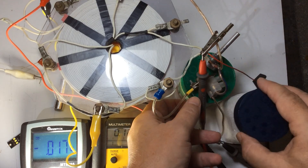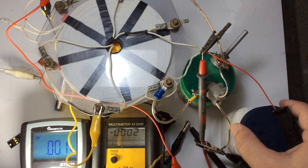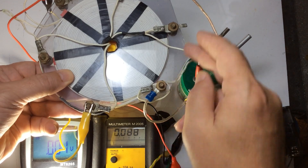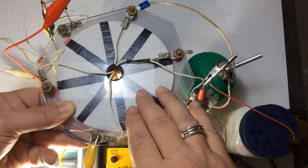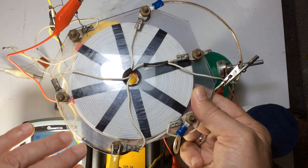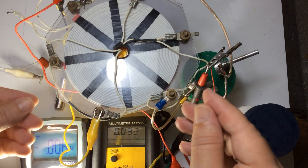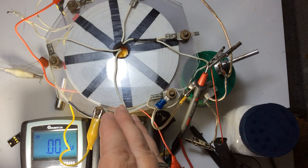So there are two coils here. Closest to my fingers is coil number one — two wires, one on top of the other, forming a two-layer winding. Then coil two is layers three and four. Each coil is as close in dimensions as I could make them. One coil is the drive coil and schematics will be at the end. On this side we have three terminals — the drive side, and the three terminals underneath are the output side.